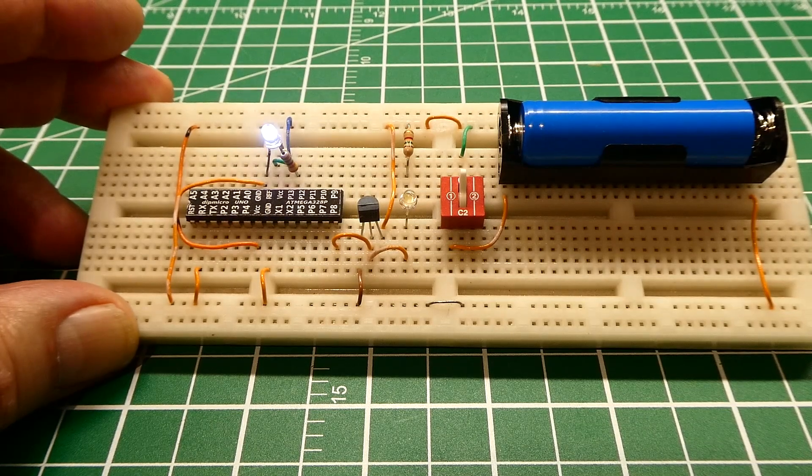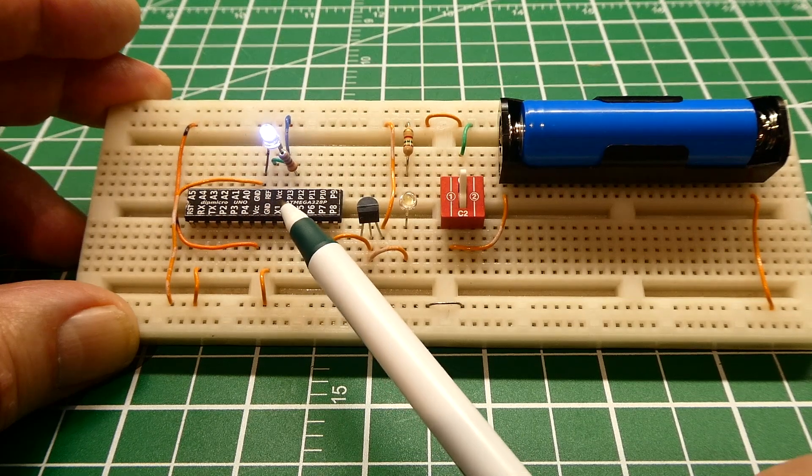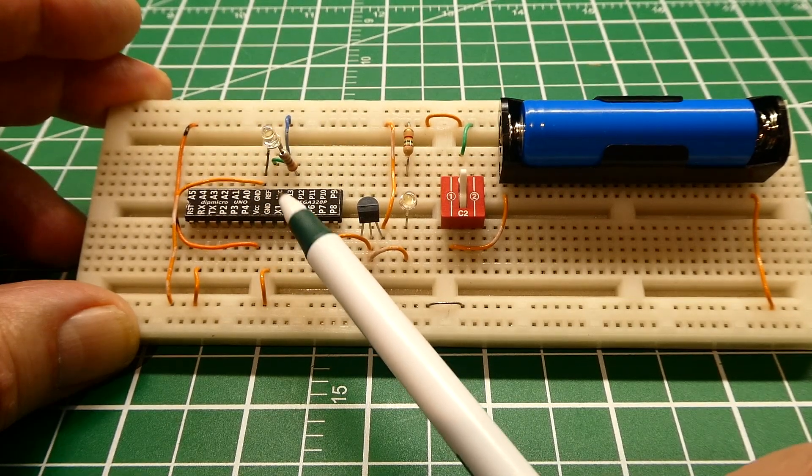So how do we build a very simple low battery alarm? There are many ways to do it. We could use the ADC of the microcontroller, but there's one problem: the battery voltage is fed to the VREF on the microcontroller, so as the battery voltage drops, so will the VREF, and it will indicate a fully charged battery all the time.